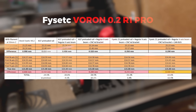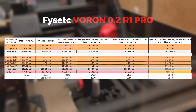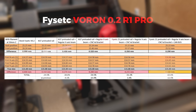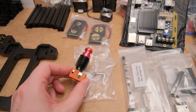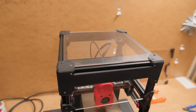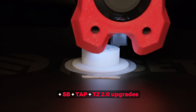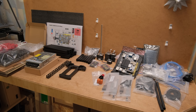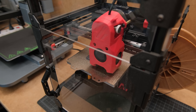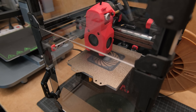I don't need to talk about how much the thick wireloom with loose rails affected print quality on this printer, plus the included custom hotend is not even high flow rate. I feel like you need to change too many parts on this printer and even the lower price doesn't make it look like a good deal. So while I liked their Voron 2.4 kit and the value it brings, this Voron 0.2 kit feels like a mess — with unnecessary upgrade parts where other types of upgrades would make way more sense.